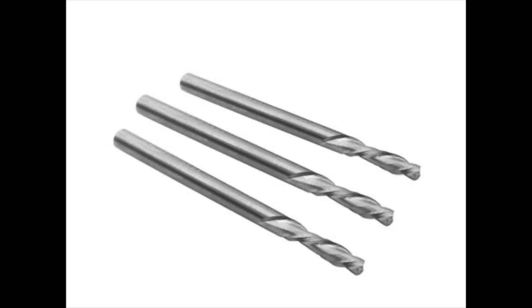The first two tools you're going to need are end mills — the quarter inch end mill and the eighth inch end mill. The quarter inch end mill is great for removing a lot of material quickly. You're also able to carve simple designs and logos with circular geometry since the end mill is round, making it great for curves and circles. The eighth inch end mill does the exact same thing but on a smaller scale, and is better suited for smaller logos, designs, and images.